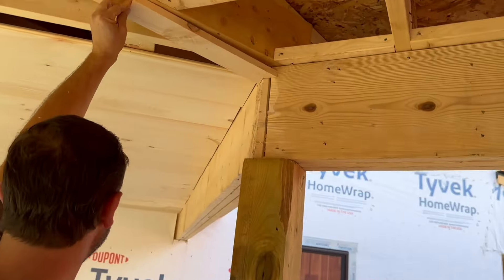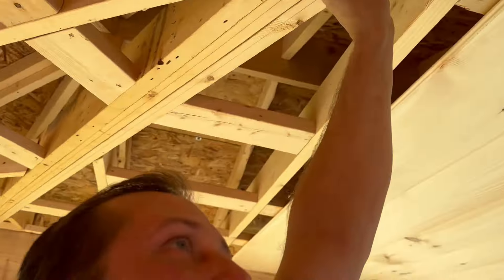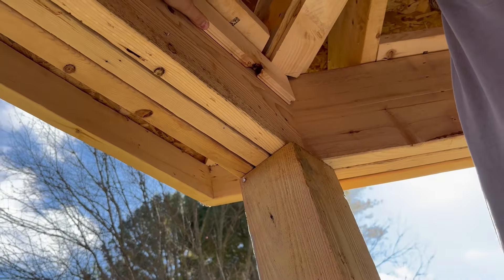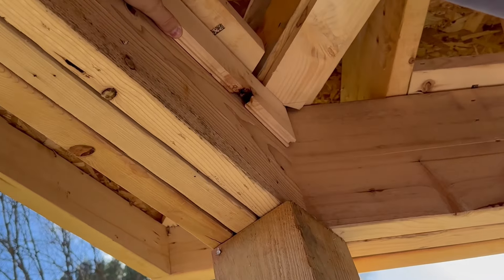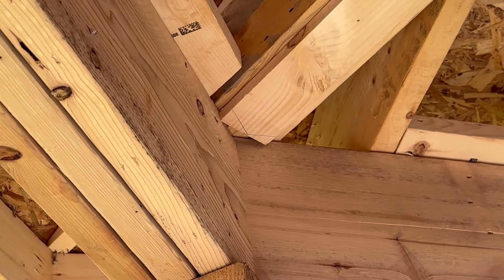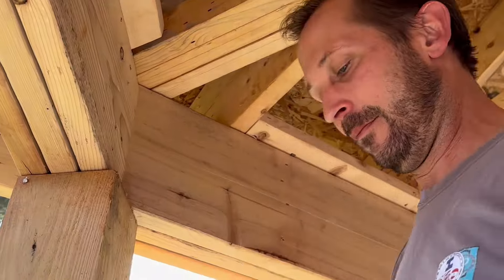While we're making the actual piece, Ray is making a template to wrap around the beam. A quick way to figure out the angle of the dangle is to hold your piece up, stick another piece against it, and trace — that mirrors the angle. Once you cut it, it should work.